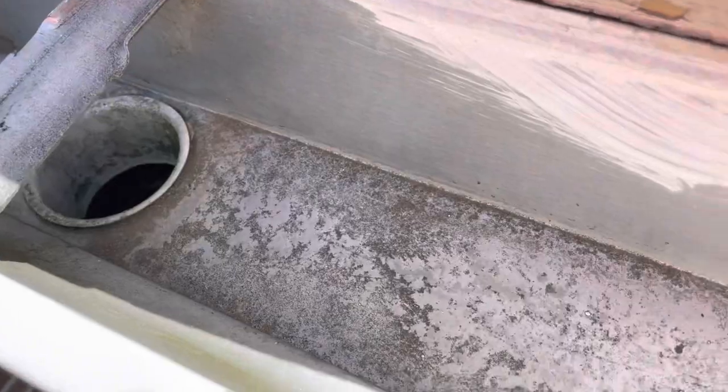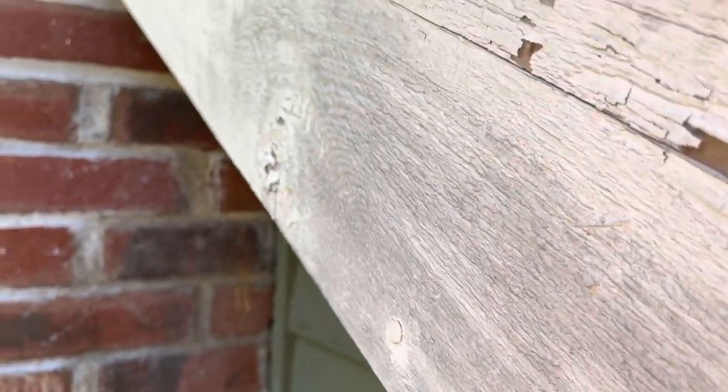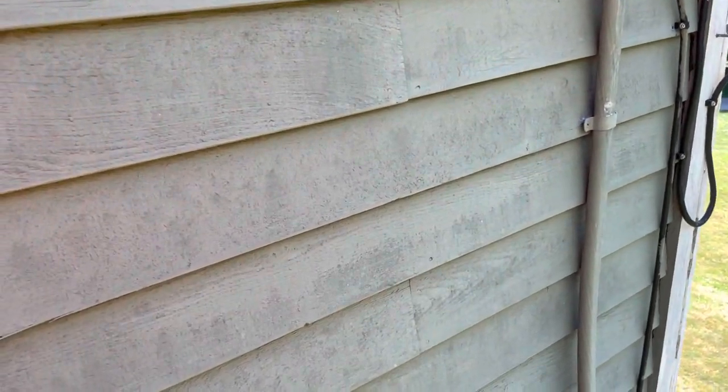All right, off to a great start. Nothing in this one. And you can see this black dingy mold all over this siding. If you come down, you can see it on the green. And this is painted cedar shake siding, only a few years old. I'll be washing this today with the normal 1% house mix that I use on everything, with a nice rinse and no pressure, and this should change dramatically.